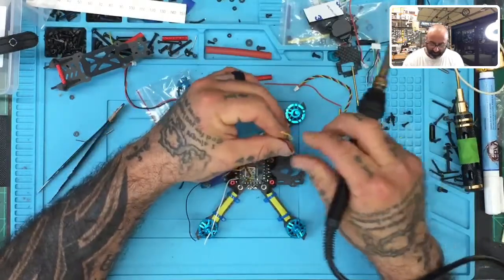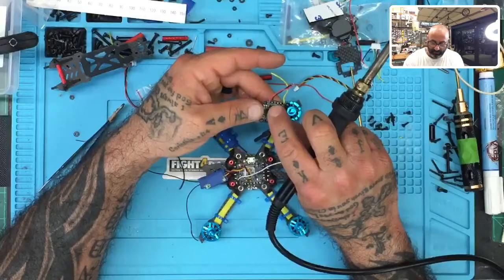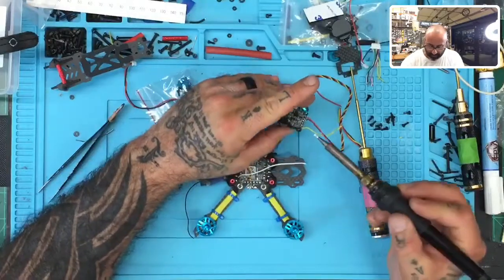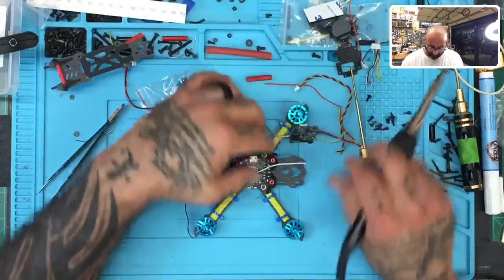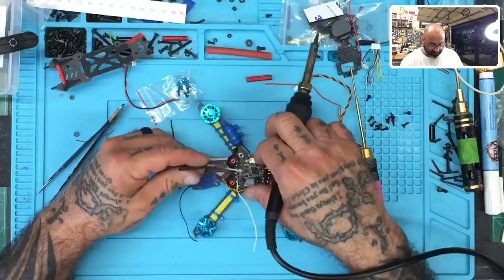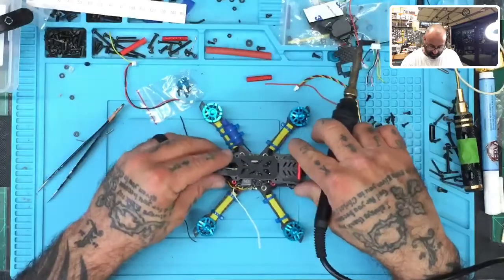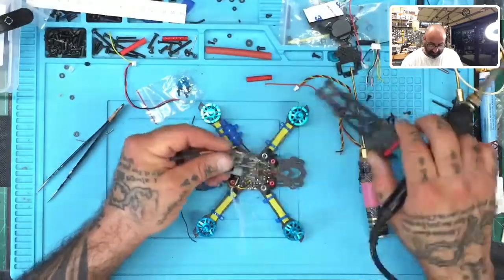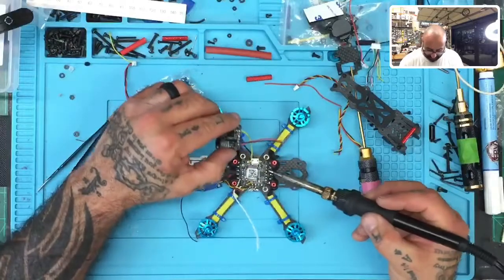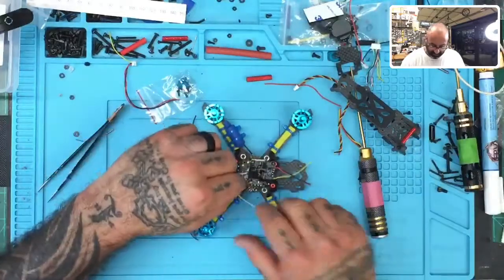So what we're gonna do is we're gonna wire these, and then we're gonna bring this smart audio cable, this wire that we ran to TX6, and we're gonna wire it to the pad number 3 underneath that is for OSD out, okay? Or smart audio out, right? So let's make sure everything looks clean here, and it does. So the first thing is going to be to see how we want this to sit. We know that the back of the quad is this way, and we know that the frame has an option for this piece to go right through. Okay, the question is the thing too close? And it's not actually, this would fit perfect. So we're gonna leave it facing this direction, okay? Which means that if it sits like this, all the connections are pretty much gonna go right here, and that's how we're gonna run it, okay? The only difference is we need to get the smart audio.